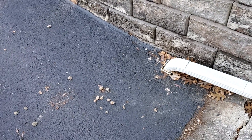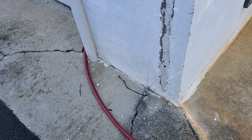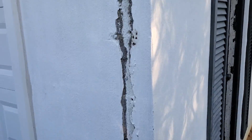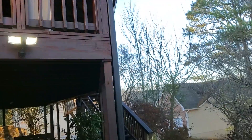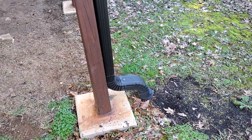The asphalt is sitting on a pretty thick bed of rock and gravel, and the water has been diverted all the way past the driveway to where that white pipe is. There was another downspout right here that was also breaking up the concrete in front of the garage. So they diverted that downspout and moved it over. Now they've got this downspout going down into the ground and being diverted to a pop-up valve sitting right out there. Redirecting downspouts like these is well worth doing to get the water off your house.